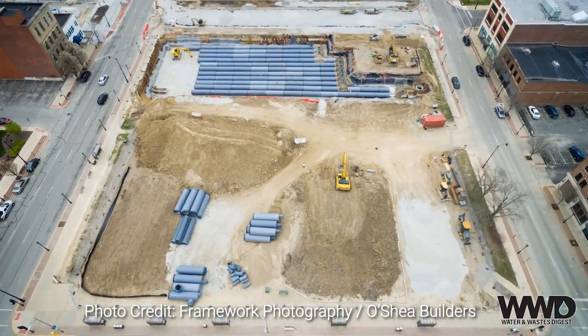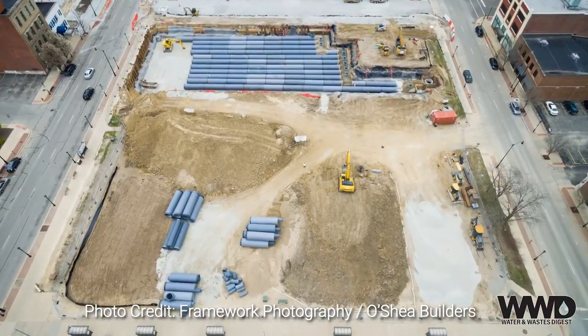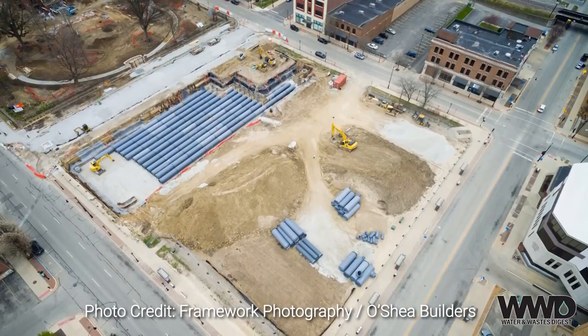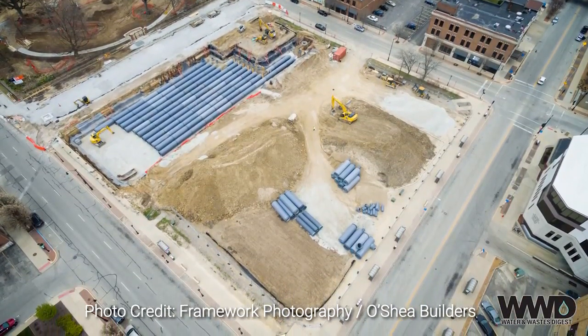Because of the contaminated soil on the property, a clay liner went in all around and enveloped the whole system. As we would dig down to our elevation, we'd put a sand bed down, then put our clay liner down, come up with the pipe and all our backfill, and then when we got to a foot above the pipe we would wrap the liner over the top of it.